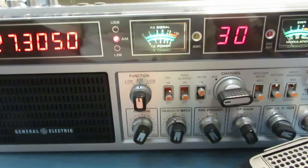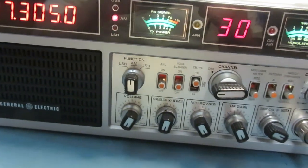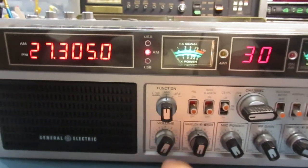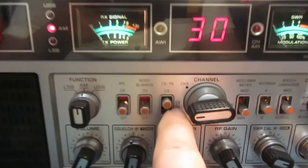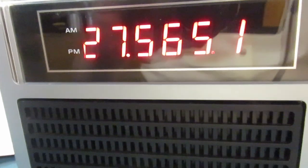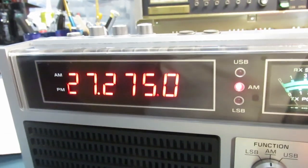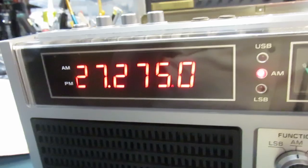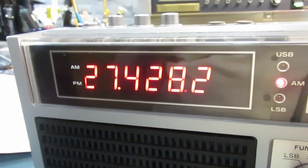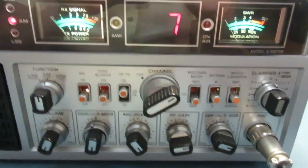Oh, one last thing. You just saw me flip a channel, right? Okay, this video is going to get a little longer. Sorry, guys. There are two things you have to understand here. I did put extra channels on this radio, and I used the CB PA switch. So when you go down, you're going to see this guy go up to channel 59. And when the switch is up, it's just regular. So channel 27 becomes 59. You see that? It goes all the way down. So that makes it easy peasy, simple, just one switch for extra channels.